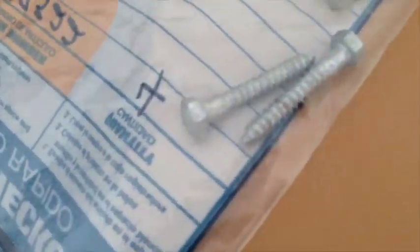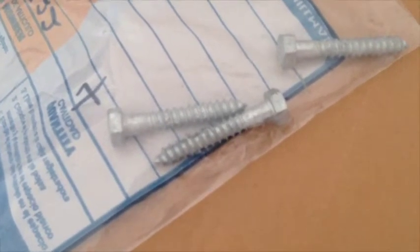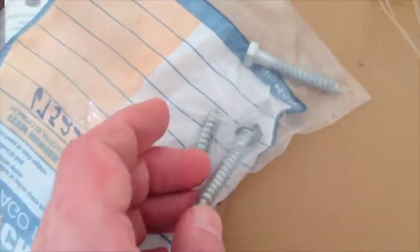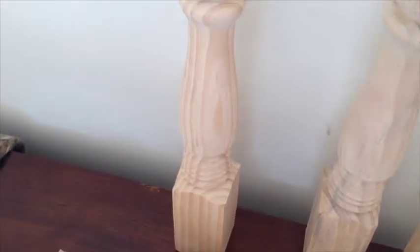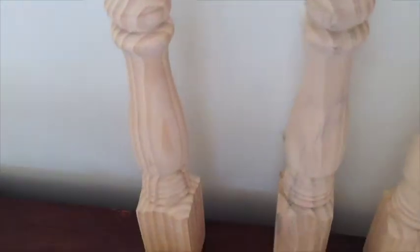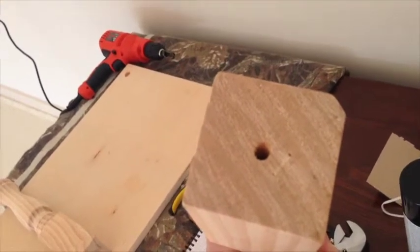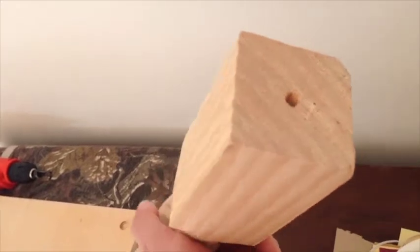The grip into the hole is going to be very stout for that hex nut head being down inside that epoxy. When that epoxy dries, it's going to be pretty solid. These bolts that I got at Lowe's Hardware were a little bit longer than the hole that is pre-sunk in these wood legs, so it just meant I had to use an open-ended adjustable wrench to put a little muscle into cranking. Just be aware that if you're using these same prefabricated legs, the hole that comes in them isn't deep enough. What you could do is sink your drill in there and just drill it down a little bit deeper — it certainly wouldn't hurt anything. You've got a good guide there.